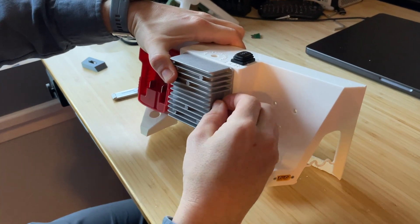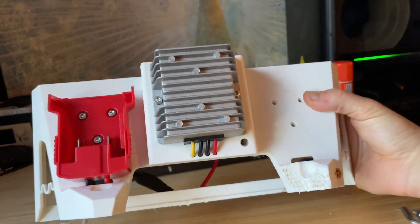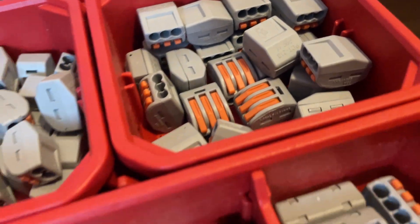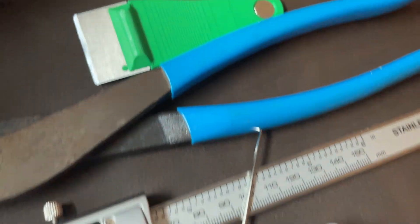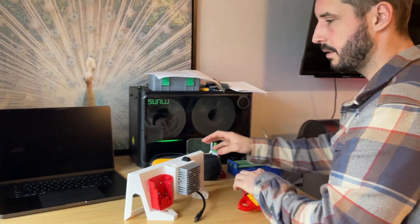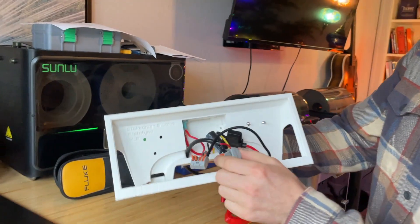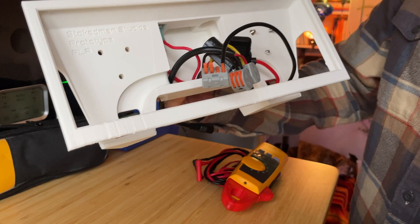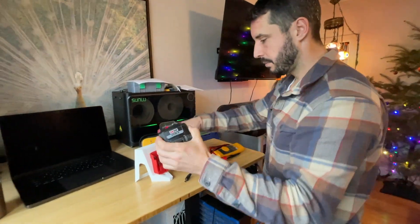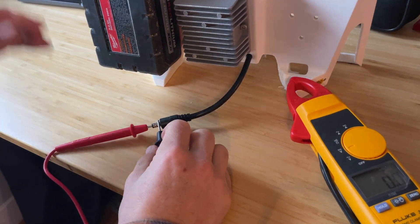Just testing the converter. What are you getting ready to do? Getting ready to test the voltage — we're supposed to get 57 volts. I'm going to try it on the battery. So first time doing this setup, this is just the prototype. I temporarily connected it, obviously put a fuse and used those quick connectors for now. This battery — hopefully it's charged halfway, should be good. Positive is in the middle and negative on the outside, so we're going to turn it on.